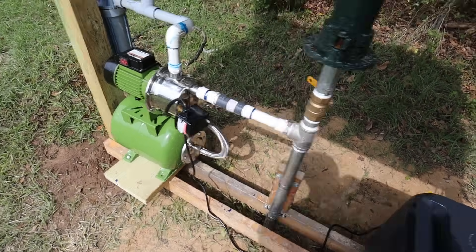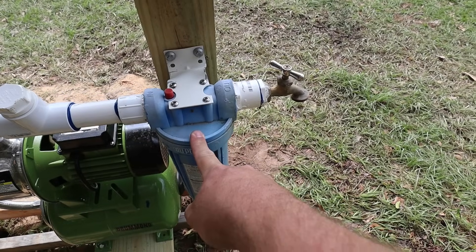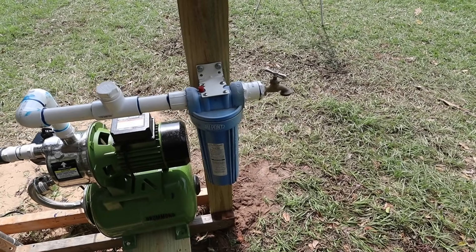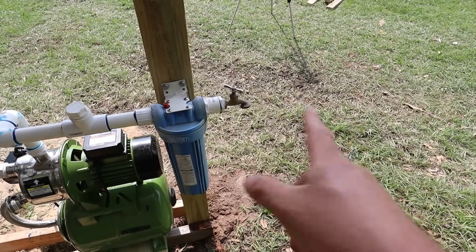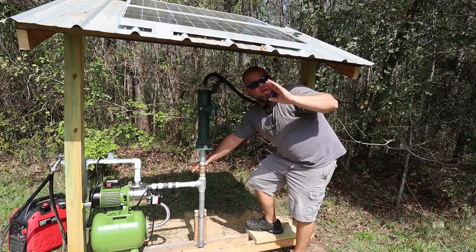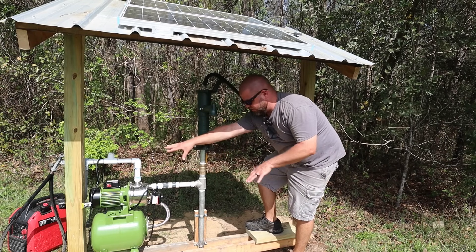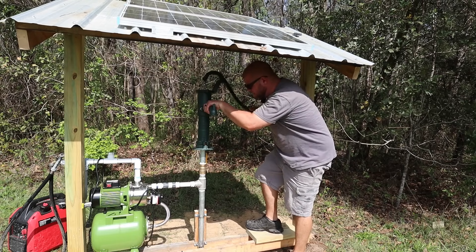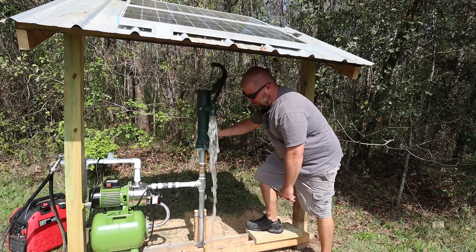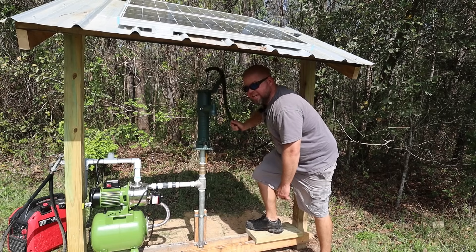Because I had an old DuPont water filter laying around, I can now pre-filter my water for sediment. This takes two-and-a-half inch cartridges, and I literally have about a hundred of them I bought at a great deal. Right now I'm just letting it all run through to flush and clear the well out. If we want to run the hand pump, all you do is open this up — we have a check valve here so we don't lose pressure from the electric pump side. We're already primed and ready to go. Look at the amount of water coming out — and it's nice and clear.